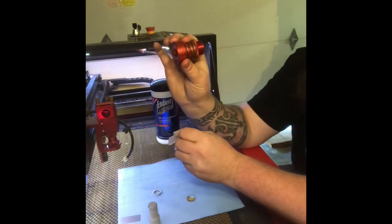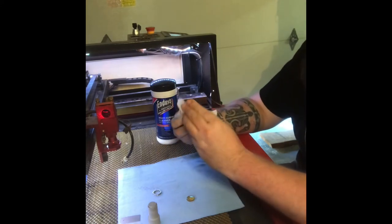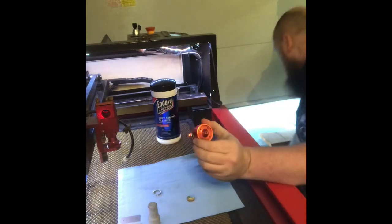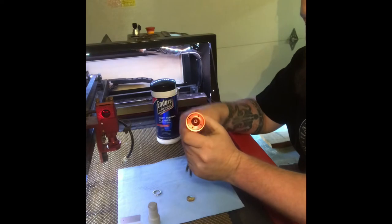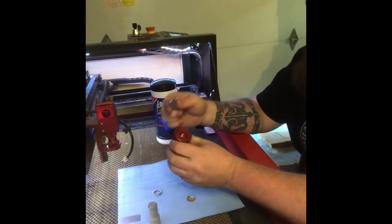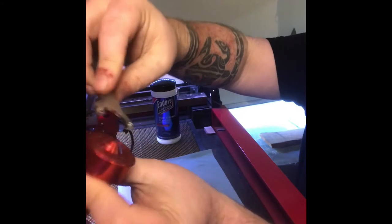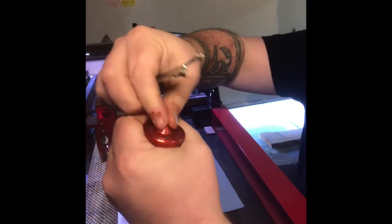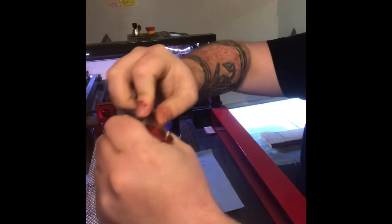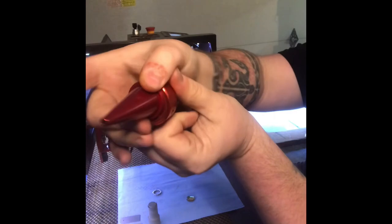Give it a look through, make sure it's not clogged up and she's good to go. Clean around the edge, just get some of that resin off. Now if you're going to be swapping out your laser nozzles for a different lens — like going from a 2-inch lens to a 4-inch lens — then you're going to need this tool. You've got these little dots and this tool with nipples on it that fit right in there, and you can pop it open and spin it open to put the new lens on. It's as simple as that to change out to a different lens.